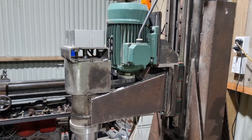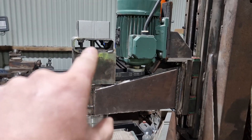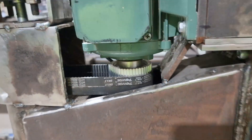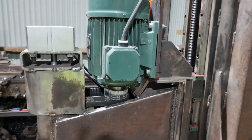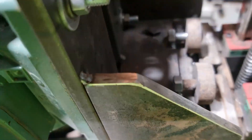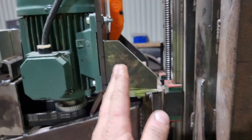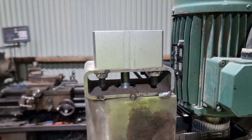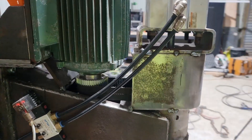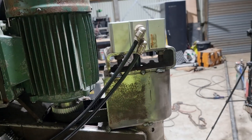I did all the welding on all the parts, then built a housing up top to act as a guard so the belt has some protection — I'll put sheet metal across there as well. I also mounted the three horsepower AC motor. I built tensioners into it so I can tension the belt, and built a simple frame for it all to sit on. Over here there's an air cylinder on top which gets activated for the automatic tool change, and on the side a solenoid valve to move air down and back for each tool change.